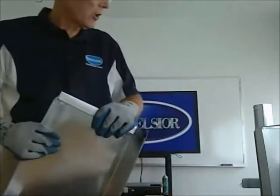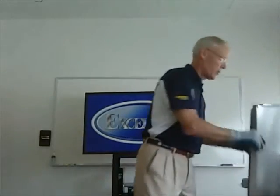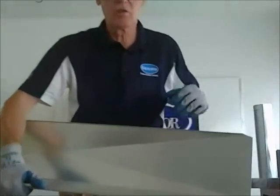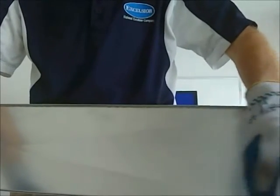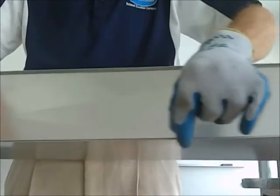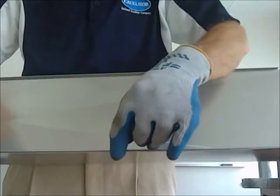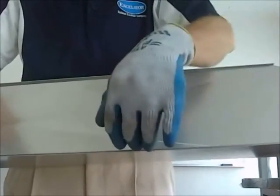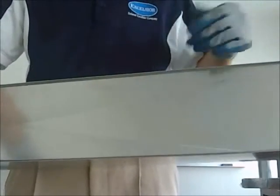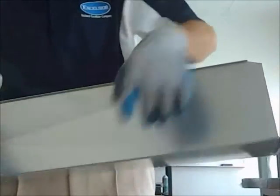There's another term called green lock seal. You see this more in commercial ductwork. In the pocket of the Pittsburgh seam, they would put a sealer when they're making it, so the contractor doesn't have to put tape or mastic coating along the outside, which is very labor intensive. So some people call it the green lock seal.